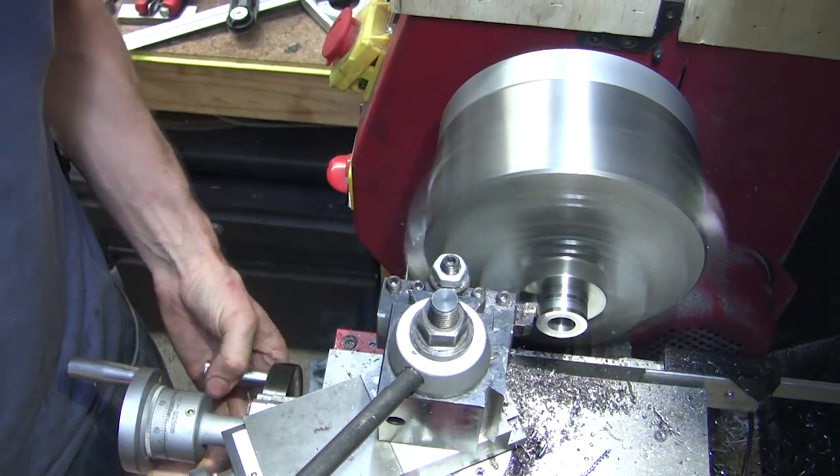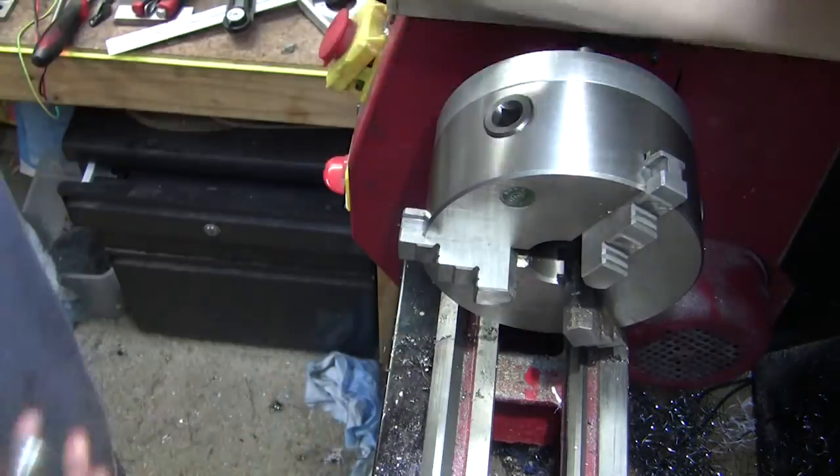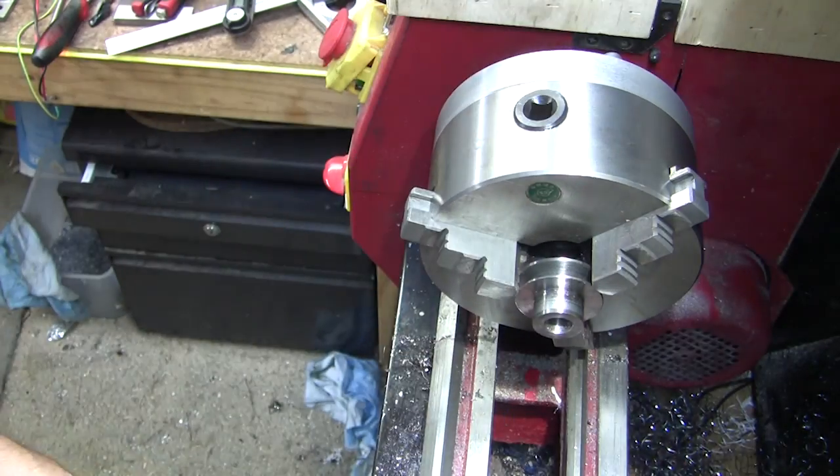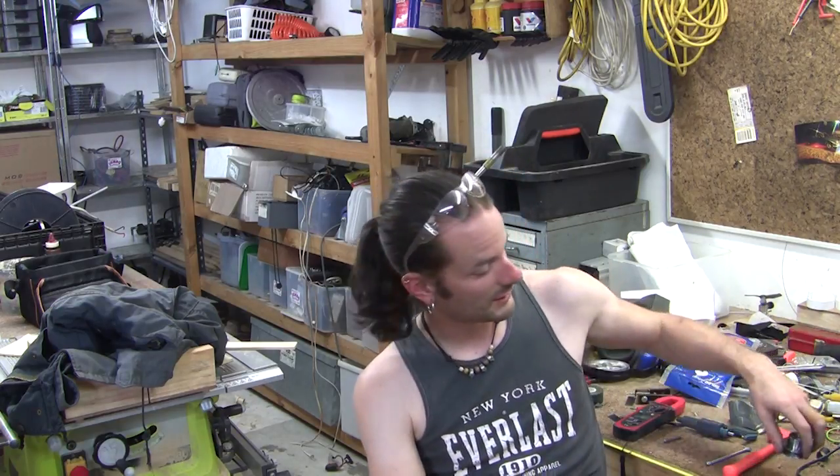So let me just face that off. This is when I could have turned down that back section, and just add a chamfer. And don't forget to chamfer the outside. Thanks for watching — that's the pulley almost done. We have to broach the keyway still. I'm going to do that in the lathe — I'm going to make up a high speed steel tool and use the lathe kind of like a hand driven shaper. Hopefully that all goes to plan because I've never done it before. That'll be in another video. Please like, comment and subscribe. Thanks for watching. I'm the Home Distiller. Bye.